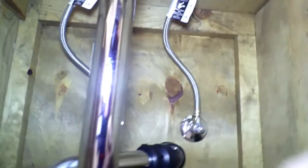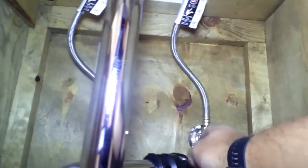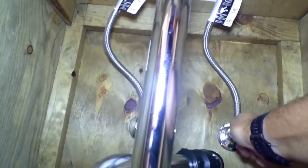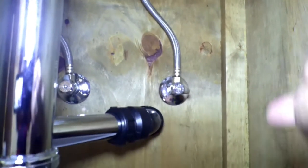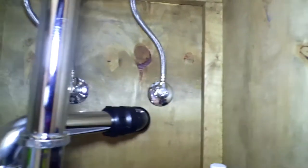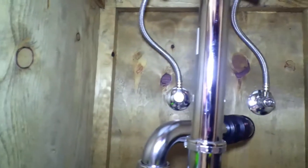That goes the same if you're looking underneath the sink. Let me take you underneath my sink. Here we go underneath the sink — you're looking at the valves. There's a hot and cold. It's in line — water is on. Quarter turn. Now water's off. That means the water is off. You turn it back on — water back on. That's how you turn the valves on and off. A lot of people don't know. It's good to know.